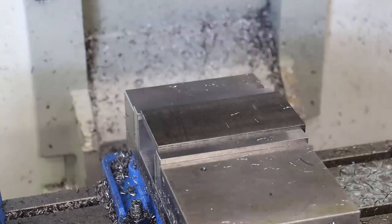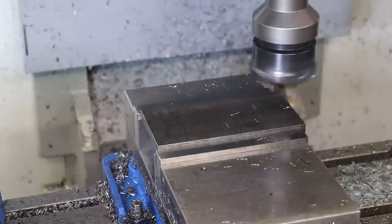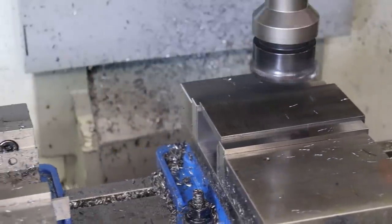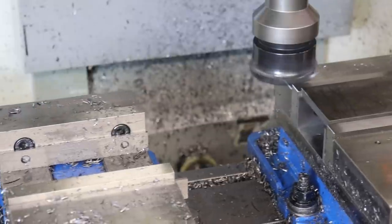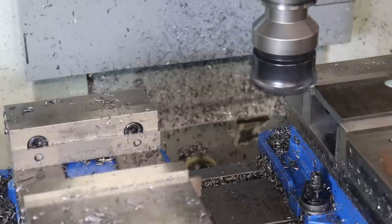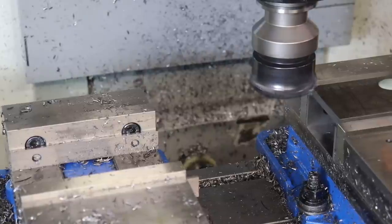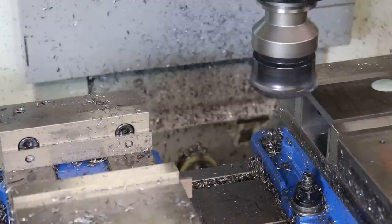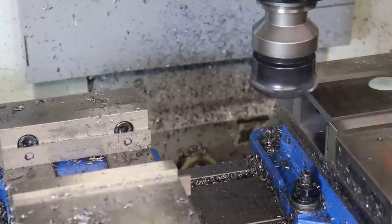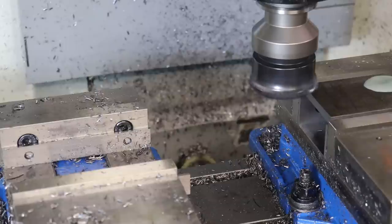When you're milling cold rolled material, or actually most materials that has any strength to it, you risk warping the stock because a lot of times there's stresses on the skins of these metal bars. So if you come in and you start machining down through the stress layer on the surface from the work hardening operation from cold rolling, then when you pull your part out of the vise, it curls up on you because the other side of the bar still has the original stress in it. So I'm only gonna take a tiny bit off here and probably wind up grinding the back, which is still relieving stress, but it's a little bit of a risk to play around with planing off steel.